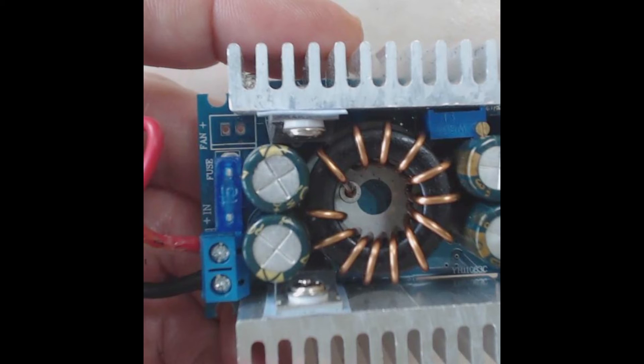The second thing I don't know about this unit is the fan connection. It shows zero volts when it's on standby and under initial load. I can only assume there's thermal circuitry in here that would turn the fan on, or I just have a unit where the fan provision does not work. It depends on whether the fan is connected to the input side or the output side — in my case I decided to wire the fan to the input side, since the output side will be over 18 volts and 18-volt fans are a little hard to come by. If anybody has additional knowledge about this unit, a schematic, or knows how those provisions work, I'd love to hear from you — just leave me a message in the comments.